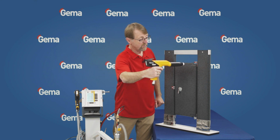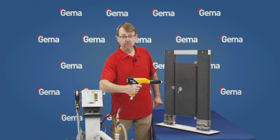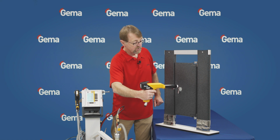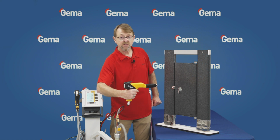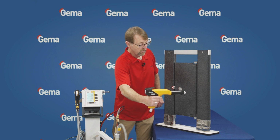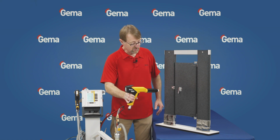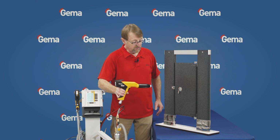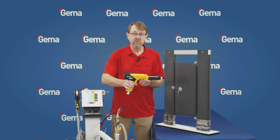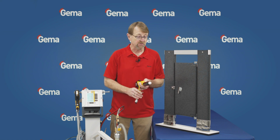we would just traverse across the panel in a zigzag motion, overlapping about 50% of the pattern each time we're moving. And again, trying to go as slow as possible to achieve a good uniform coating. In this particular angle, it's hard for me to hold that 6 to 10 inch distance, but again, I'm trying to keep the gun at a good distance away so that we maximize our charging efficiency, going slow, and taking advantage of the pattern shape that is being emitted from the nozzle.